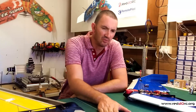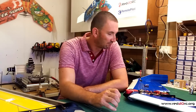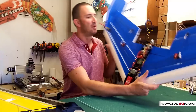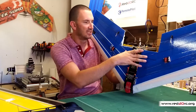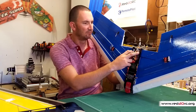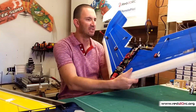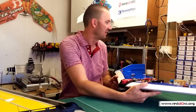When I swapped to the aerodrive, which is just a little bit heavier, I just couldn't get it to balance and it was flying very tail heavy. The first flight with that motor had plenty of power but it was pretty crazy. So with this version — exactly the same layout, exactly the same sweep and size — I've brought this section of the wing forward a little bit and also brought the bulkhead for the motor forward to bring the weight into the wing more. I've also swapped to some stronger metal gear servos, and we've got slightly longer winglets to see if they improve stability.